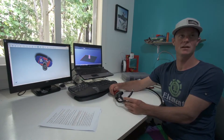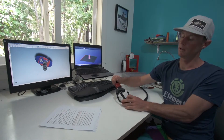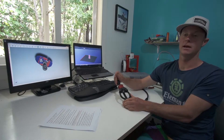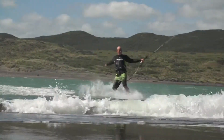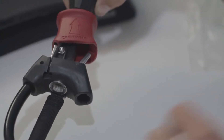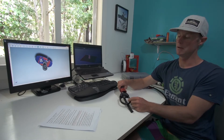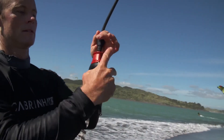Both parts are polished stainless steel, and that makes them extremely frictionless. So when you reload it, all you have to do is plug it in this hole, and that locks onto the bottom of the pin, and then by dropping the handle, that locks the pin in place so the end of the harness loop can't be released. One of the unique things about this system is when you release it, the handle actually stays up on these little posts, so rather than having to hold this release handle up with one hand and use your other hand to push the hoop in, it enables you to just with one hand push the hoop in, and with that same hand release the handle back down again.